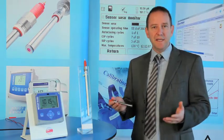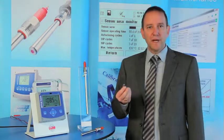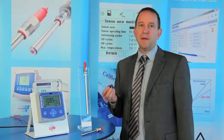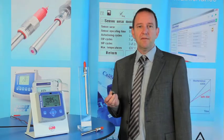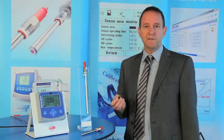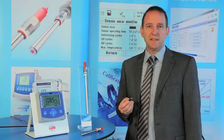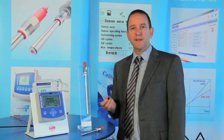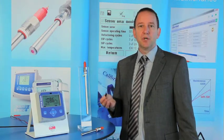The upside for you is less maintenance, less complexity, and more reliability in your process. Our engineers have developed a specially designed membrane module for a wide range of background gases that ensures a low signal drift. As a result, the membrane-covered sensors provide accurate measurement values with a resolution down to ppm level of oxygen concentration for long periods of time. Because this membrane is also insensitive to moisture and dust influences, no gas sampling system is usually required. Therefore, the sensor can be placed right where it matters to detect the real oxygen level, meaning in the process itself.